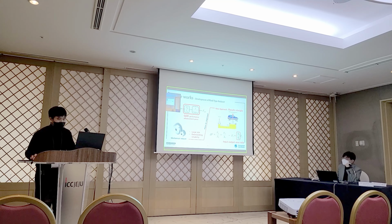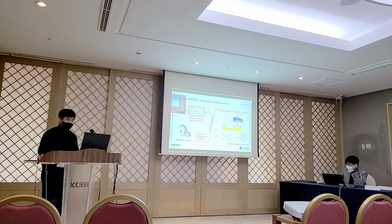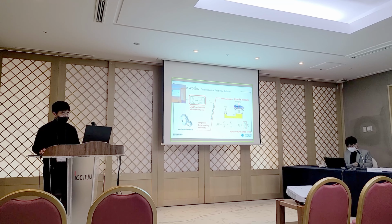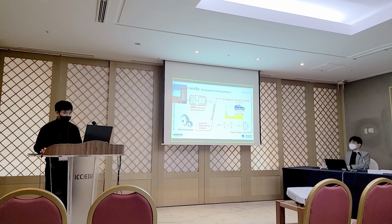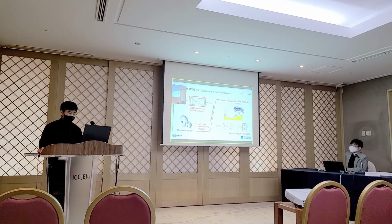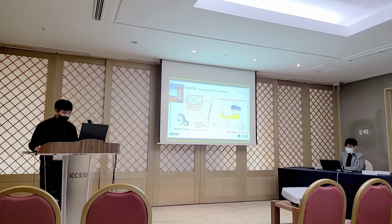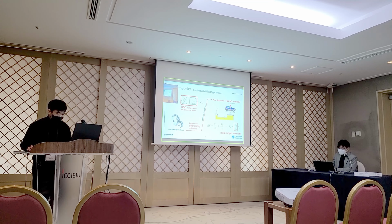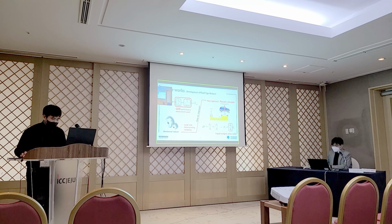From now on, I will explain future work. The motor driver we have configured uses the QDD method, and since this method is basically an open loop controller, a hardware setting that guarantees continuous reliability is required. Among them, we want to maximize QDD performance by designing a new concept reducer and applying it to the lever machine, away from the mechanical reducer that inevitably has a large volume and gradual performance degradation. By applying the Pascal principle, we can implement this.